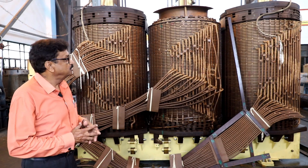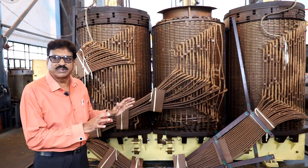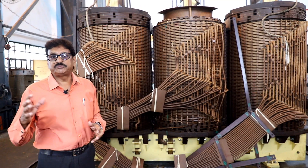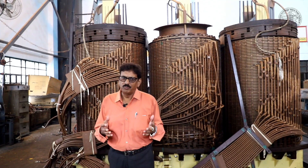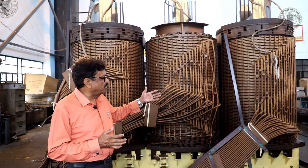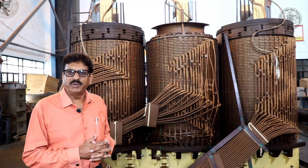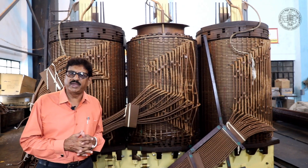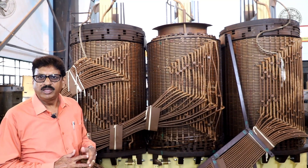This is basically a cylindrical winding. I have such an internal part — we replace them one by one inside. We reduce repairs by replacing just the damaged parts. Many spare parts are available here; original manufacturer parts have been purchased. We replace the winding components — if there is a damaged part and the transformer's voltage capacity, power capacity, and manufacturer name are the same, we can replace the HV, LV, or tapping winding.